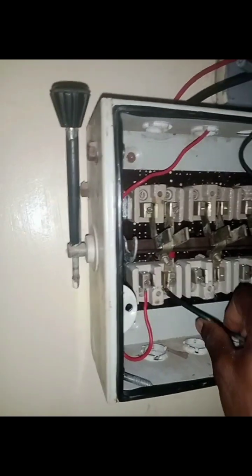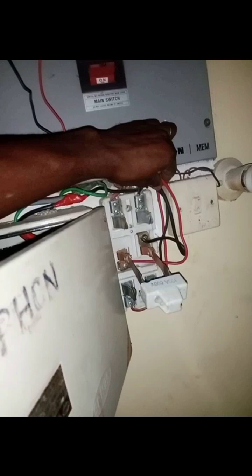These are the two cables coming from the inverter output. I'm going to put this one right here and the negative cable at the other phase of the changeover switch. For the load cable, I'm going to put the load cable one right beside this place and the other one here. The cable looped from the knife changeover switch I'm going to put at the upper part of the changeover switch.